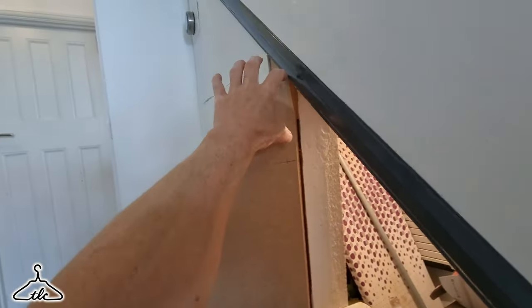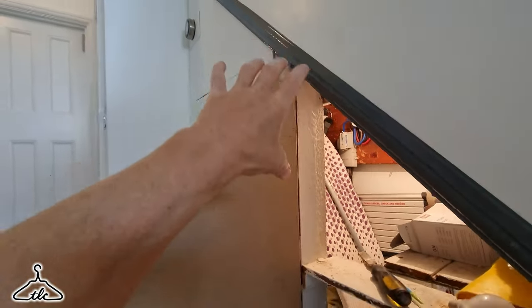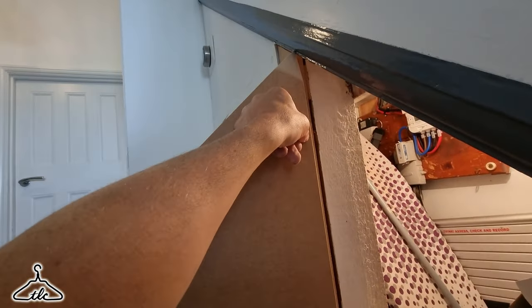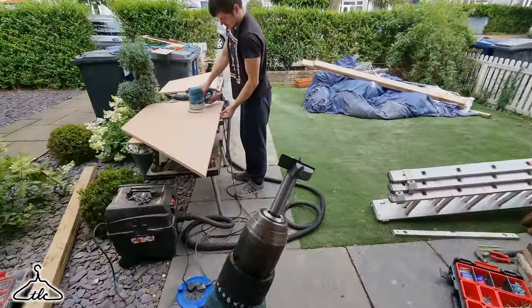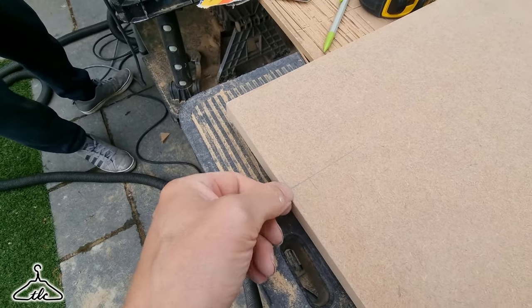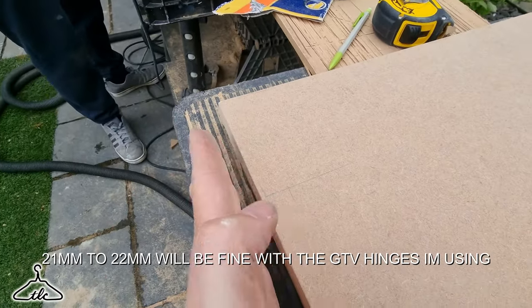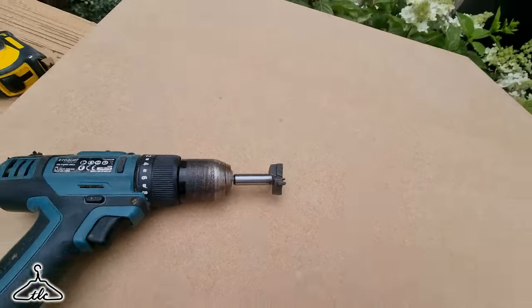I've put the door in place and we're working out where the hinges will be. Usually we come down 100mm but at 100 it would be a nightmare to get the screws into the frame, so we're dropping to 150mm - that's what we usually do with angled doors. The bottom one is 100mm up, and the middle one goes in the center of those two. We come 3mm from the edge to the start of the 35mm hole. We've got a 35mm hinge cutter bit. Sean has already marked the lines - about 3-4mm tolerance from the edge to the start, realistically coming in about 22mm from the edge. When drilling, drill to the flat part of the hinge as a stopper and guide.